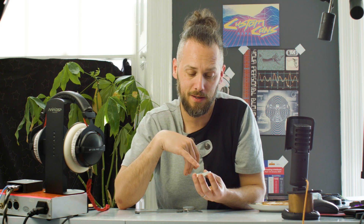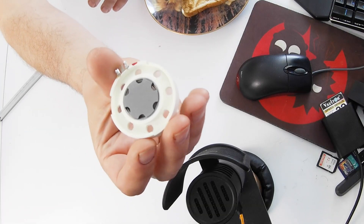Theoretically it's going to make the driver lighter so it can move a little bit faster. Also, the air in that center section has to move in and out of these tiny little holes in the back, so the driver can move faster — but it'll have less surface area, and it might be the wrong shape.